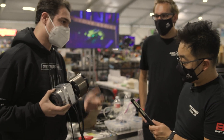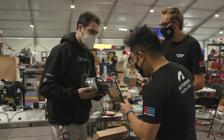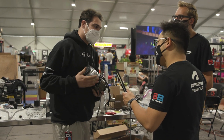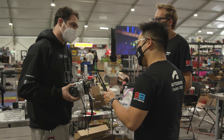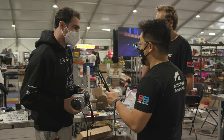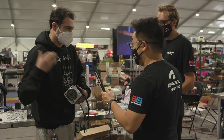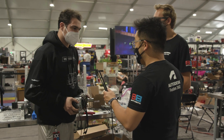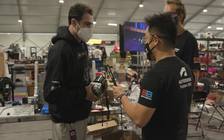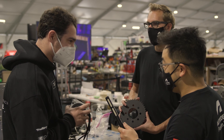This motor can deliver a ridiculous amount of power, and right here we have a harmonic drive 45-to-one gearbox. The load rating on this gearbox, however, is about 98 newton meters for continuous load and a peak load of 145. To lift the robot we need to deliver 950 newton meters to our arm, so we need some extra reduction. Right now we only have a two-to-one reduction, but with this sprocket and another piece being made for us, we should get closer to a five-to-one reduction, which will easily give us enough power to flip robots without mulching the gears in the gearbox.